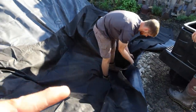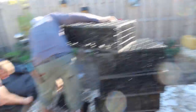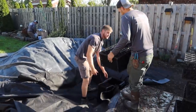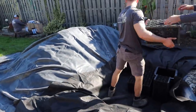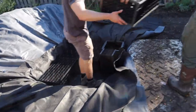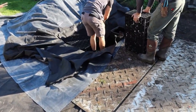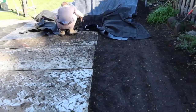They'll put the pump vault in and then stack their aqua blocks — I believe it goes one, two, three, and then just two rows of three going back. Once that's done we're going to backfill using some of that dirt — you can see the big mound behind us. It will not be a three-foot tall waterfall; it's going to be more like a 16 to 18-inch tall waterfall coming in on top of the aqua blocks. We dug the aqua blocks down about six inches below the top of the patio so we give ourselves a little more water storage and can bring that water right up to the patio. We also have an auto-fill line that we're going to install.